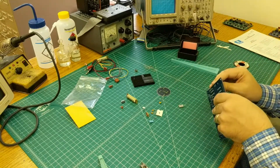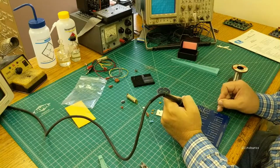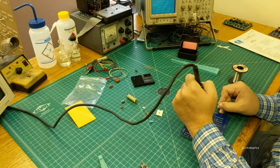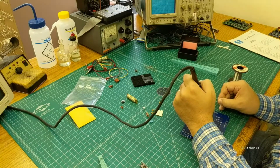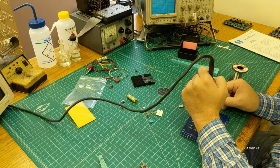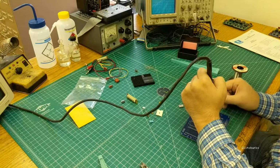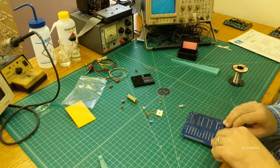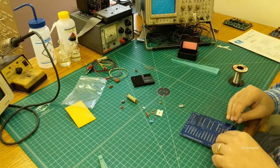I've had some folks ask online why we use 22 microfarad when one will work, and it's mostly because we have about 10,000 of these capacitors in stock, so we use them on everything that uses a MAX232. And using a larger capacitor, if you're being reasonable, is not a problem on these things. It also allows you to draw a few milliamps of plus and minus 10 volts off of these. So if you're designing something where you need plus and minus 10 volts for like an op amp or an ADC or a DAC or something, that's a convenient trick to pull it off of an otherwise 5 volt only board: steal it off the MAX232.